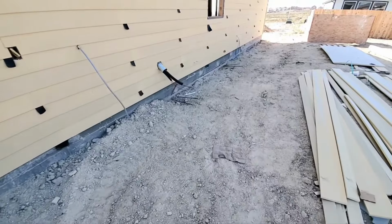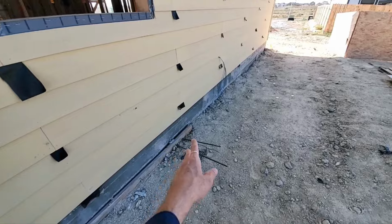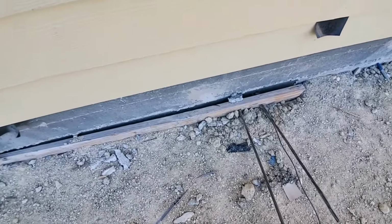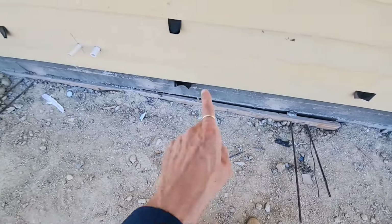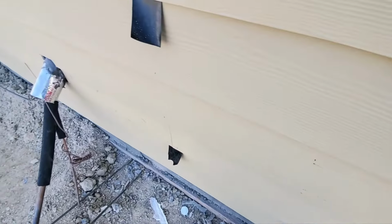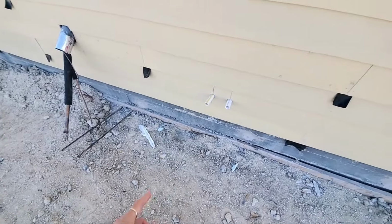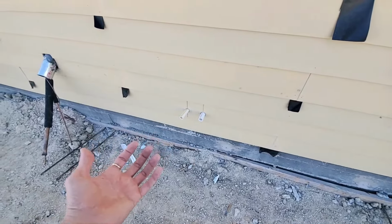On the right side here, man, you were spot on with these tendons that had not been tensioned. And I can tell you why they did it. It's because there were gaps on this side, and the concrete held on and just bit down onto this bottom form board. And that did not allow them to be able to pull it off when it was time to come tension these tendons. So, of course, this should be done 7 to 10 days after they do the pour.